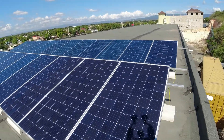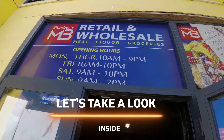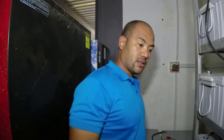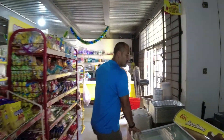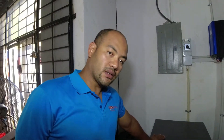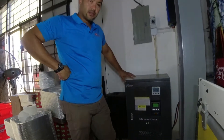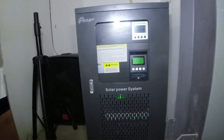And because it provides for the nighttime hours too, with a sizable battery — here we are, kind of tight behind the refrigerators — all the batteries are set up and we have 24 essential maintenance-free batteries. This is our 10-kilowatt inverter and charge controller in one. This can take up to 24 solar panels, so we have 20 solar panels connected to this and another charge controller with another 20 solar panels, giving us 40 solar panels connected in total.